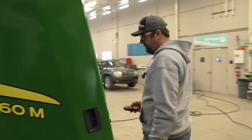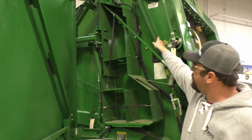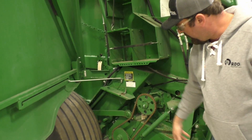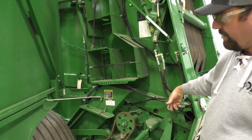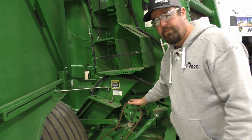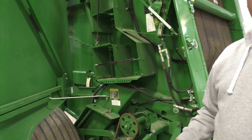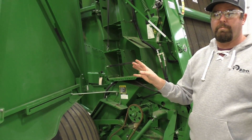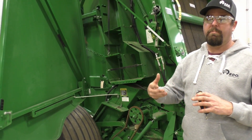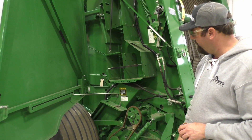Along this side, we got our other tension spring. We come off of our drive roller right here and go down to our pickup attachment — that's going to go across to the other side and actually drive the bottom pickup attachment. There is a lot of power transfer flowing through this baler. There's a slip clutch right behind here — it's a ratcheting style slip clutch. What it's got is springs pushing pistons out. As we hit an obstruction that's too much, it's going to compress those springs and allow it to slip inside. When we get it freed up, it's going to push those pistons back out. That's typically what everybody's running anymore.